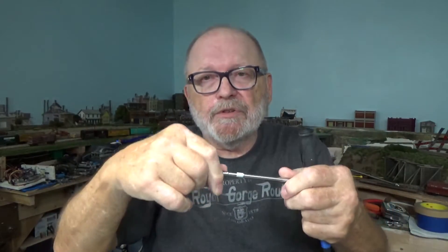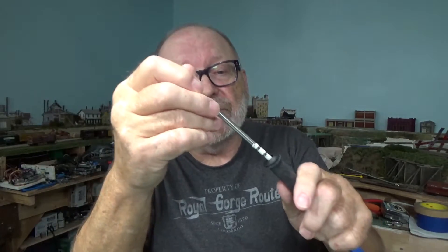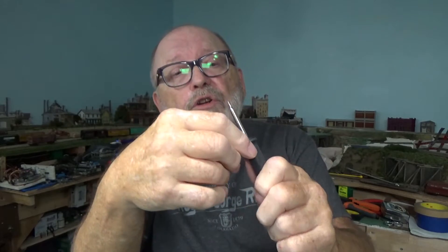It's actually a package of four soldering tips, and the one I'm going to be using in this project is a BC2, which is pretty similar to ones I use all the time. The thing about these soldering tips is you get the tip and the heating element all in one. All you do is push it down in, but you have to make sure it goes all the way down or you're going to get an error message in your display when you start it up.